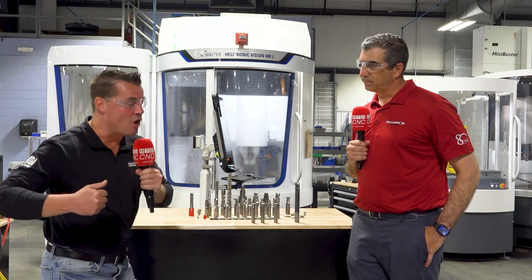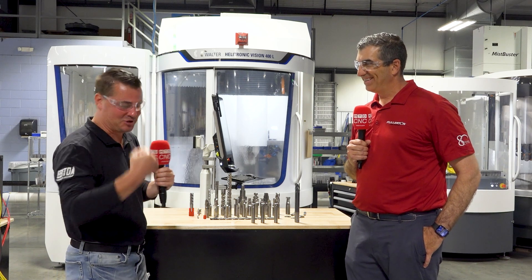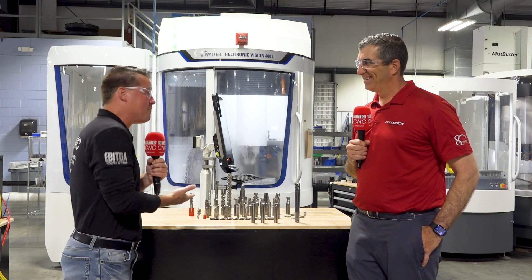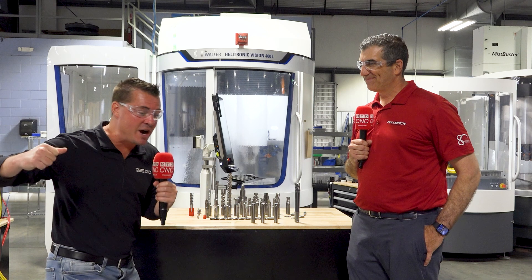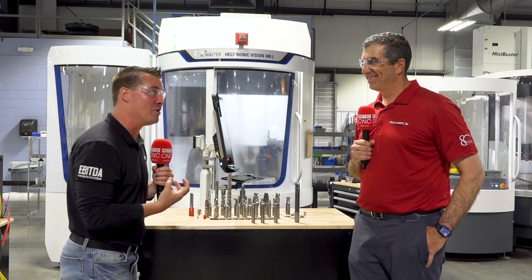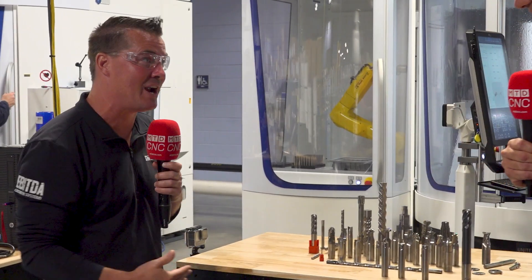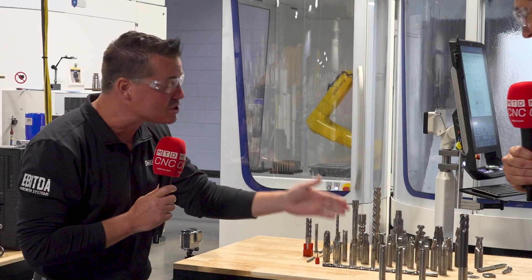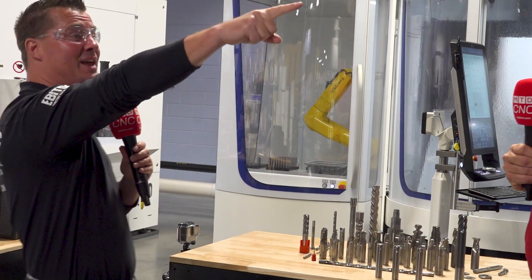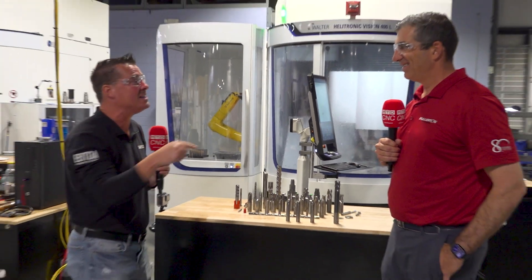Patrick, if it's okay with you, I'd like to share a personal experience of something similar where I over-torqued it. I thought the more muscles I had, the more pressure I put into it was going to help hold a tool I was getting ready to rough. I promise you, it got pulled out — and that was not good for anyone involved. Not my cutting tool, not my finish, not my cost of part, certainly not the company, and not the lead time either. That's where this really comes into play. You actually have a shrink fit machine over there as well, so you're doubling down on what you're talking about inside your own facility.